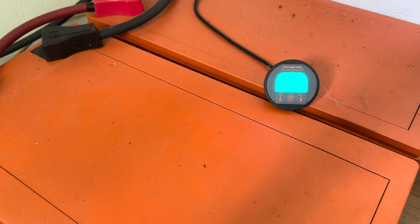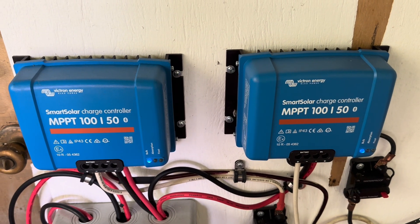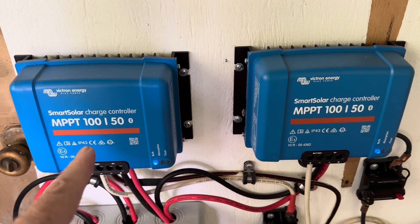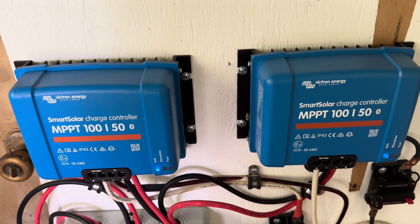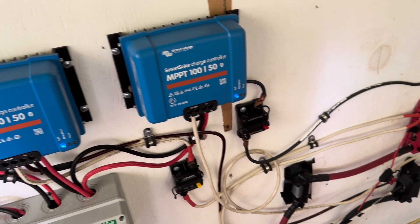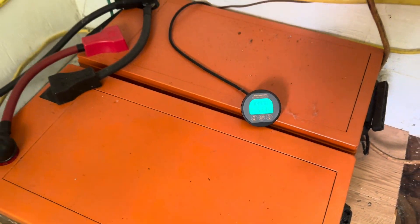Right now I'm on the second day and this 600 amp-hour battery bank is up to 53% full. I'm not going to be running any loads off of this the rest of the day — I'll see if we can get it fairly full. Just as a reminder, that solar panel array is 1000 watts, and I've got 500 watts coming into each separate string with the Victron solar charge controllers — 100 volt, 50 amp controllers. With the intermittent sunshine, it's definitely not going to get up to 100% full today, but I'm just giving it a chance to catch back up.